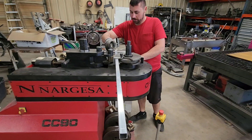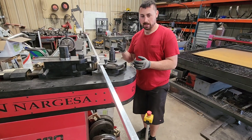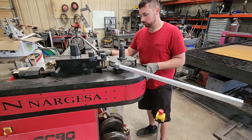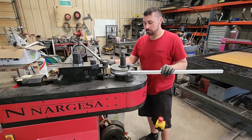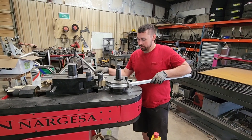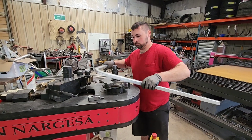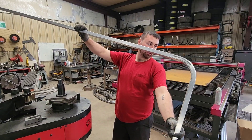We'll go ahead and hit Start and do our first bend. We put some lubricant on here so our tube doesn't get gummed up. I've noticed a lot of times with this machine you have to back it off a little bit on aluminum. I'm just pulsing the pedal here to go slower so that it doesn't get in a binder or break the material. And there's our first bend on the square tubing.